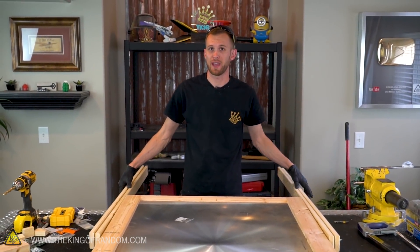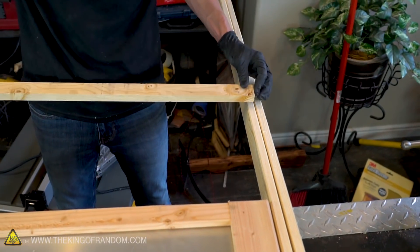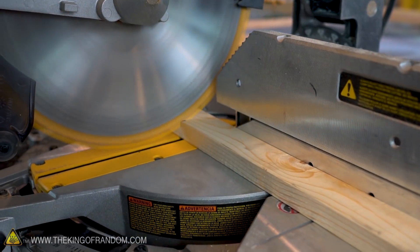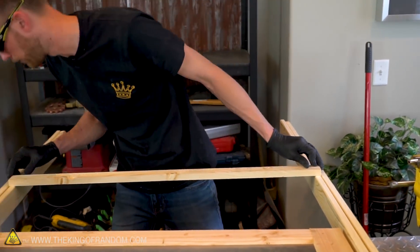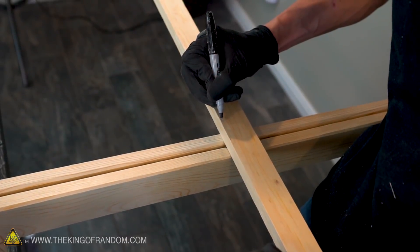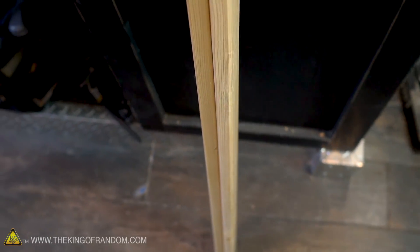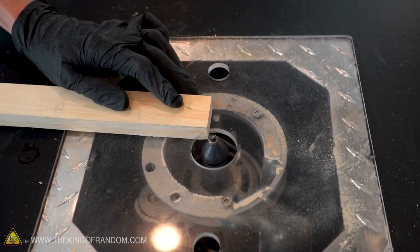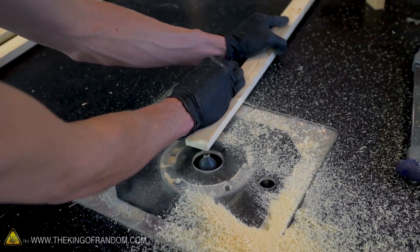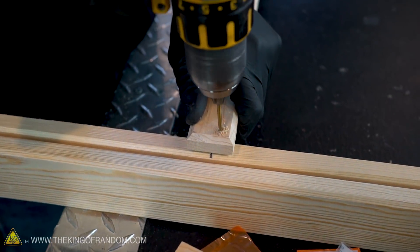To add more strength and to give us a spot where we can lay down a board to focus the solar scorcher on whatever we're trying to burn, let's add two supports on each of the legs going down the sides. I've got some one-by-two board for the side supports. Unlike on the last solar scorcher, these supports won't go in between the two legs — one set will go on top of one pair and the other set on the outside of the other pair, so it can still collapse down completely flat. The side supports are trimmed to length, edges smoothed with the router, and we'll use a couple of screws on each side to attach them.